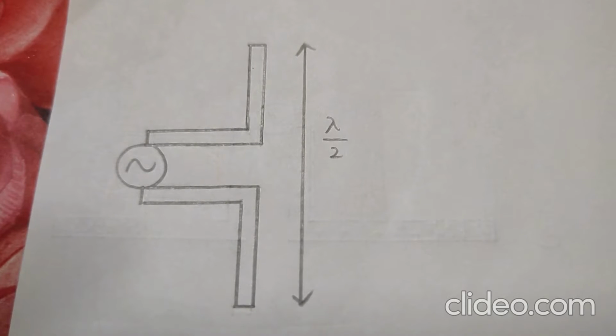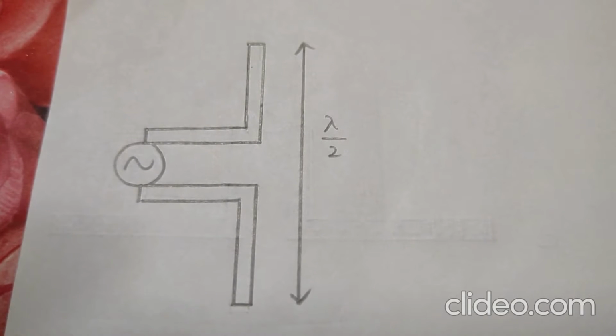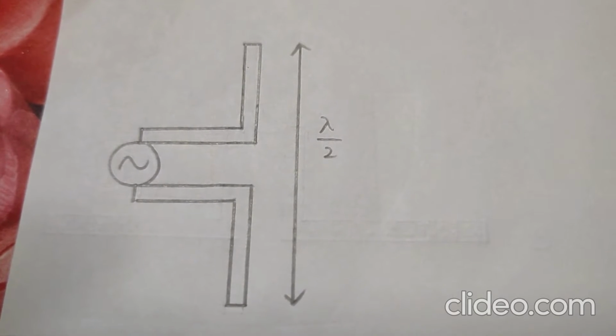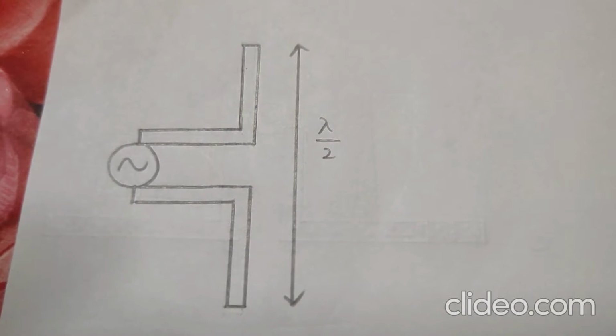A dipole antenna commonly consists of 2 identical conductive elements, such as metal wires or rods. The conductors have equal length oriented end-to-end, with the feed line connected between them. Its length is determined by the intended wavelength or frequency of operation. The most commonly used is the center-fed half-wave dipole, which is just under a half wavelength long.